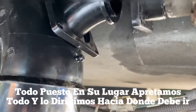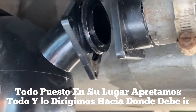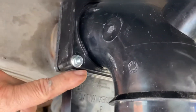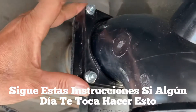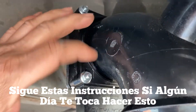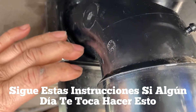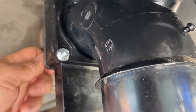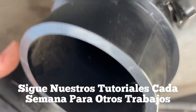This is very easy: remove the valve, remove the drain piece, get the drain piece into the tank first, then set the seal in place, set the valve, put the bolts and nuts in — don't tighten them, just screw them in by hand so you can swivel and move it.